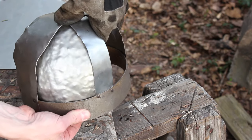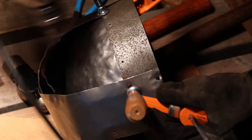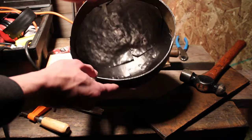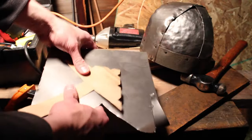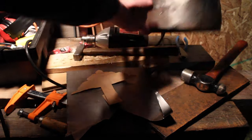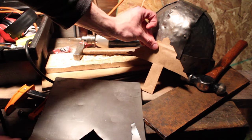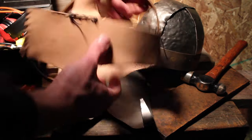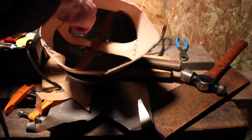Something like that is what it's going to look like. Now I just need to drill out the holes and rivet them in. Here's what the finished helmet cap looks like — all the individual plates are riveted in there with carpet tacks. Next I'm going to take some of my remaining sheet metal and make a nose guard piece that I'll attach to the front of the helm. After that I'm going to secure my leather helmet liner to the inside of the cap, and that should really be about it — it'll be done.